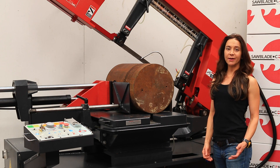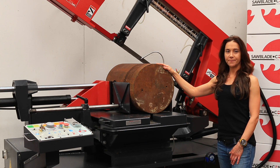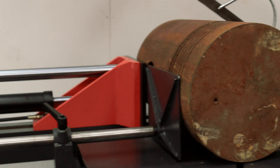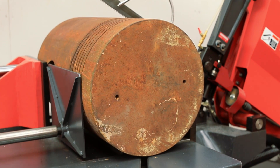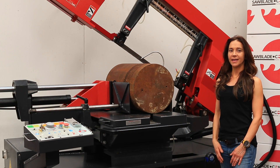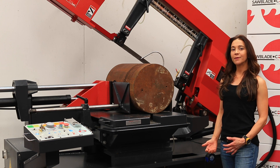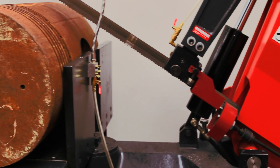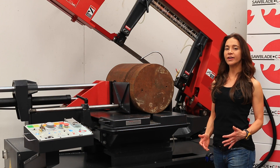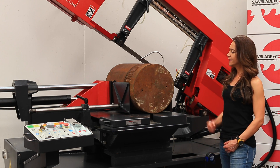Some cool observations about this piston is that it's made of solid cast steel with bearing journals machined into it. The saw I'll be using today is a widely used saw in the steel fab industry as well as in the steel service centers that need the ability to miter cut in both directions. It's the Velox 460 VSA. This machine has dual miter capabilities and an 18-inch cutting capacity. The blade I'm using today is an inch-and-a-half by 3-4 tooth configuration. This is a very versatile saw blade, one that can cut anything from hard alloys such as Inconel and titanium to structural steel. So without further ado, let's cut this in two.